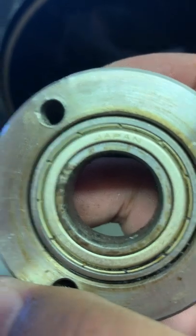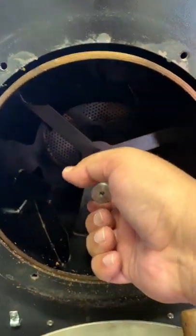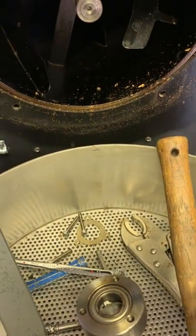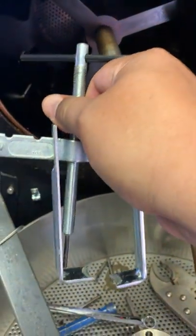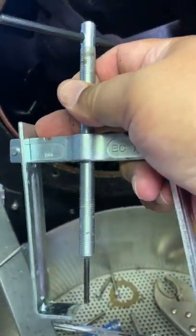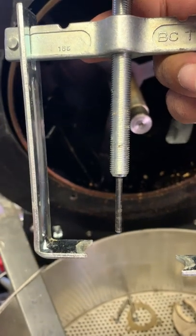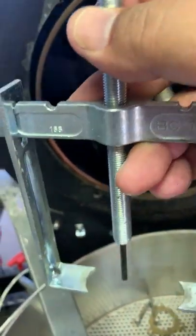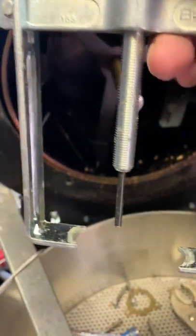These are good bearings. The machine is very sturdy. What I use to remove the piece that holds the bearing — I call it a compression ring — I use these plumber's compression coupling removers. They're normally used to remove couplings from your pipes such as shutoff valves underneath toilet seats when they get stuck. They work really great — didn't force anything, just popped it right out evenly.